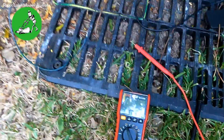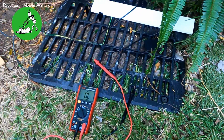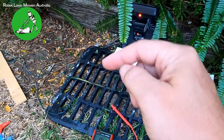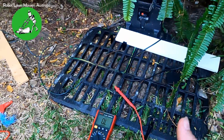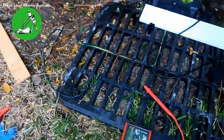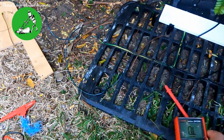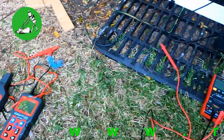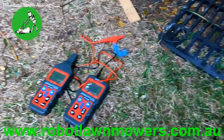Now that we know what we're looking for — in this case we're looking for something that's pretty much a complete break of the wire, or at least a break where the two wires are sitting in the ground, and we're probably measuring the resistance of the ground. So we put the multimeter to the side, we know what we're looking for, turn that off, and we revert to one of our cable locators.